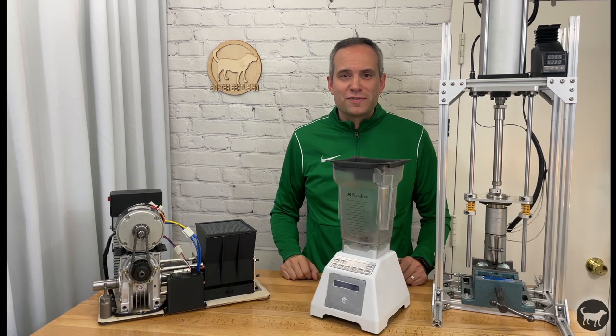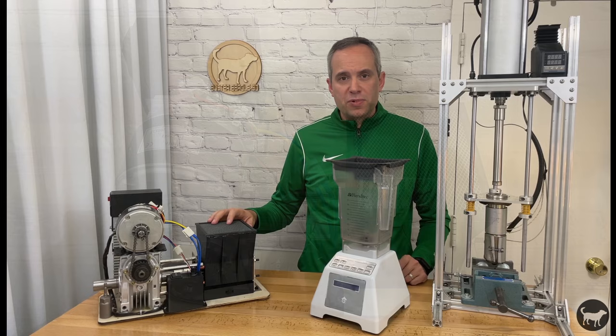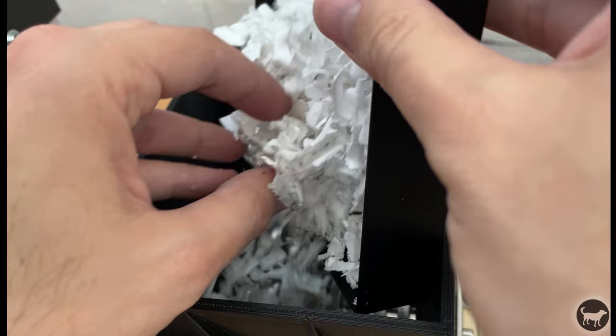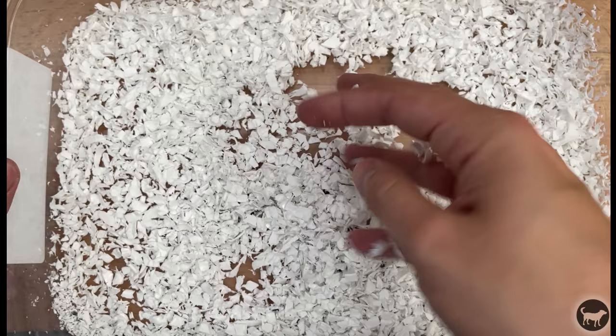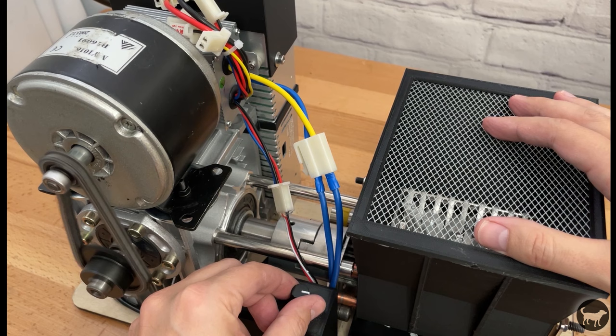I added a gear on the shaft, a drive chain, a scooter controller, and a 24 volt power supply off an old 3D printer. I then added a switch to control the direction of the motor as well as a 1.5K ohm potentiometer to control the speed of the motor. I even designed a top for the hopper to keep the plastic from flying out. As you can see from these HDPE milk bottles, it does pretty quick work of this type of thickness of plastic. I also ran the shredded material through the machine a few times to break the plastic down even further, leaving some pretty small pieces that should work great in the injection molding machine. The only real downside is that you want to be sure to clean out the machine very well between different types of plastics to make sure you're not mixing different colors or plastic types.